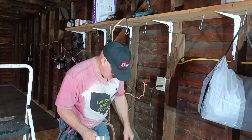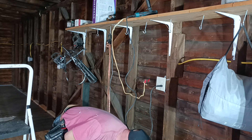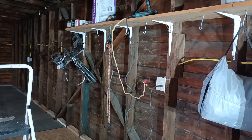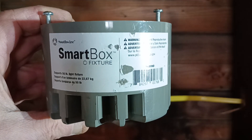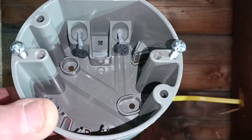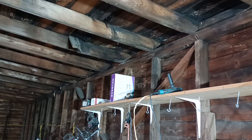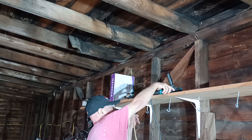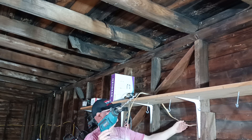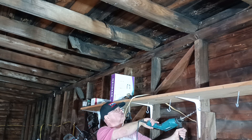That is the smart box and there are the screws that screw it in. They make them for ceiling fans with three screws and more support inside the box. I drill back an inch and a quarter so that if they ever hang sheetrock, the screws won't hit the wires.